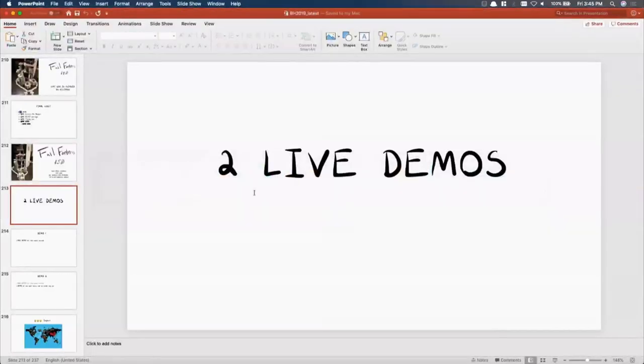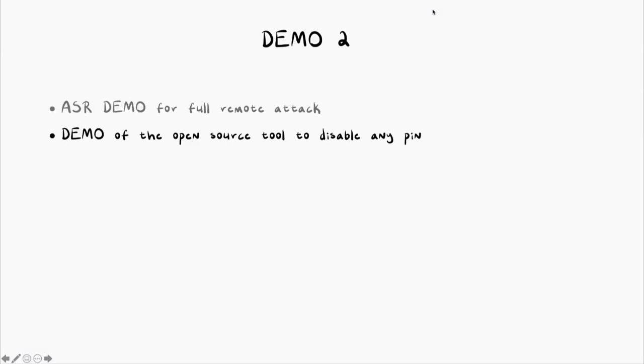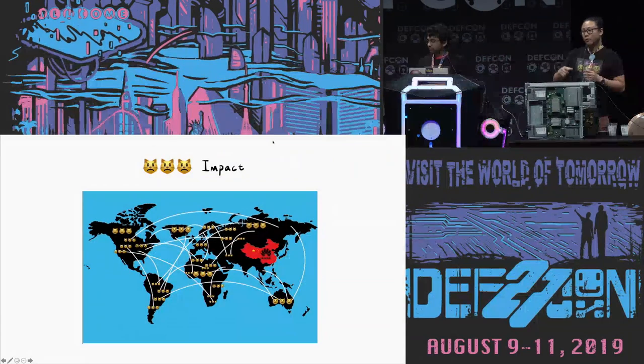The reason why we use the Mojo is that this is a very inexpensive piece of hardware that has the Spartan FPGA inside. So if you take a look at our tool, you should be able to modify this yourself and play with all of the different options of taking a pin high, pin low, input to output, and all of that good stuff. I think we're about out of time. So this is the impact.